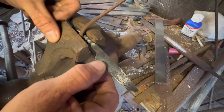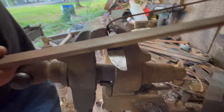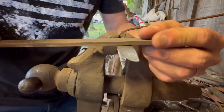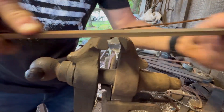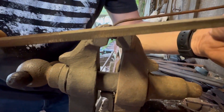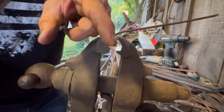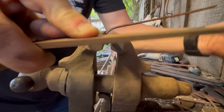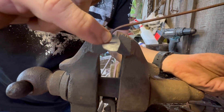Mason, can you get right out here and kind of show the angle of the file? So here's flat — just laying flat on the blade, I'm going to start out like that. So let's see if we can get her to cut here. It skates a little bit because of that scale still on there. You're not going straight for that edge immediately — you want to start bringing your bevels down. I'm taking a little meat out all the way across the blade up to just under the spine. It's cutting out an ever so little amount, and you can see it when it starts to blend in. I'm starting to see that scale going away and we're cutting down into fresh metal now.